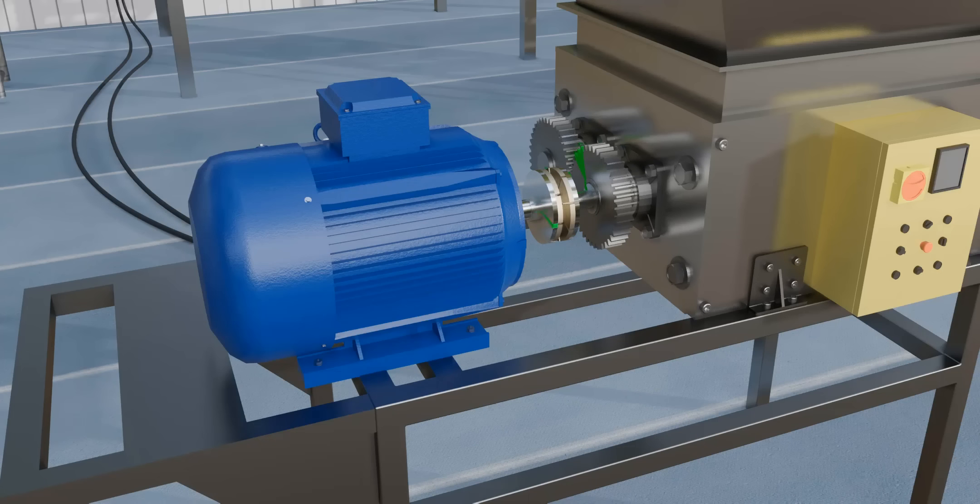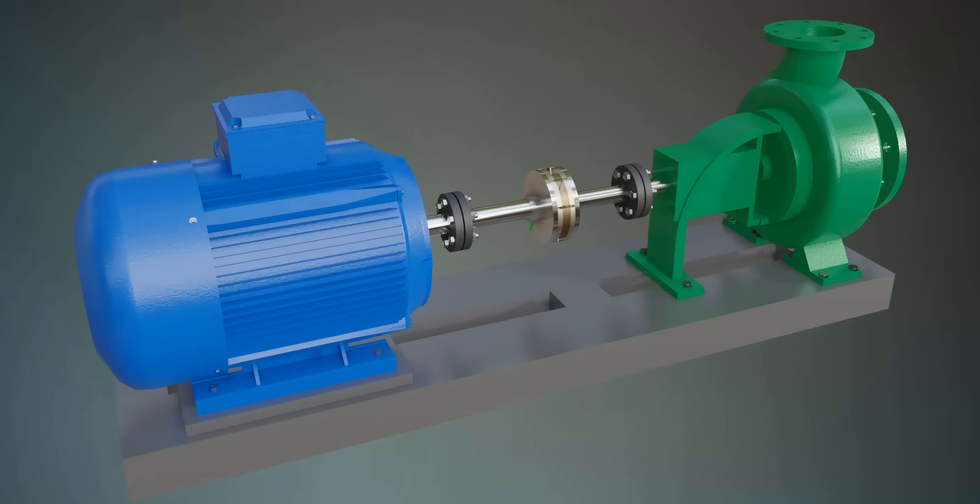The synchronous magnetic couplers are used in compressors and water pumps, as these equipment require constant speed to maintain the desired flow rate. The main disadvantage of the synchronous coupler is that if the load is working at slip speed, it may lead to decoupling.